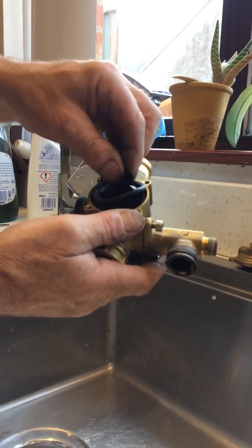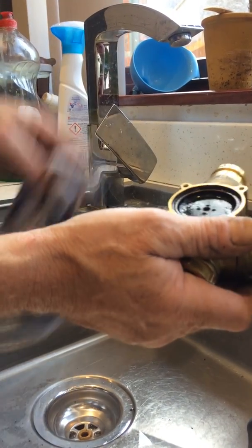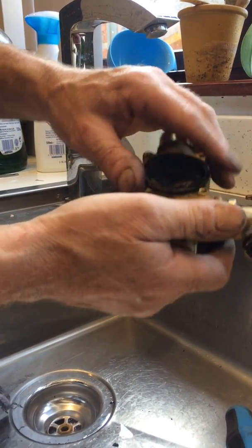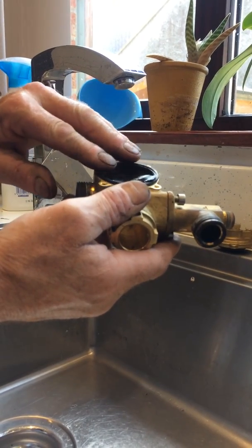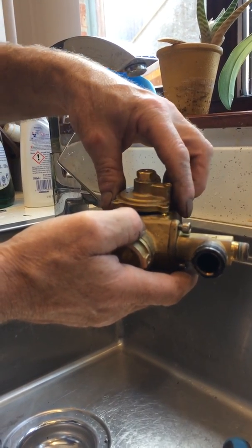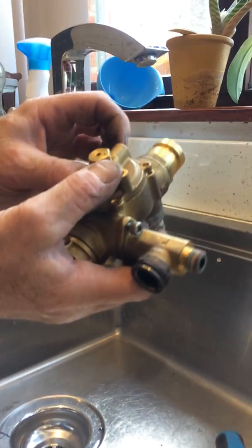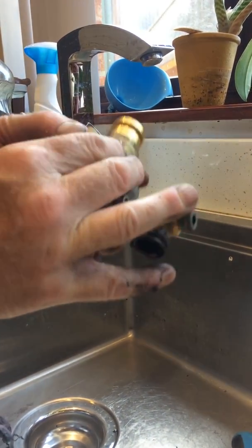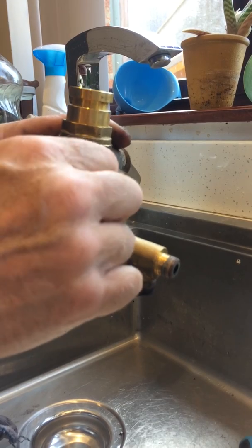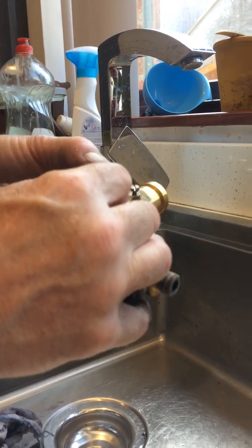On the valve itself I thought I'd ripped this, but it actually wasn't ripped — I kept it to make this video to help people know how to assemble and reassemble this valve. The new washer would go in there, making sure you get it the right way up. There's a small pipe that goes into the back of here, so just push it back in and put your four screws back in hand tight.